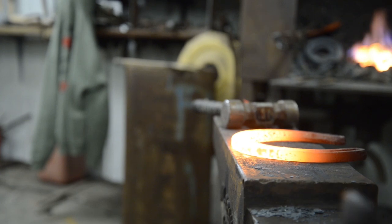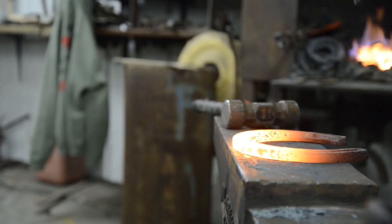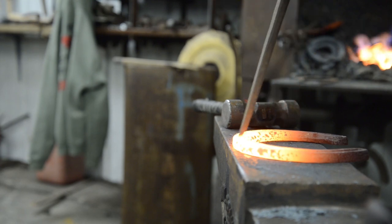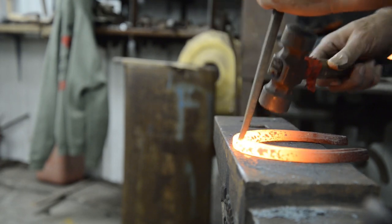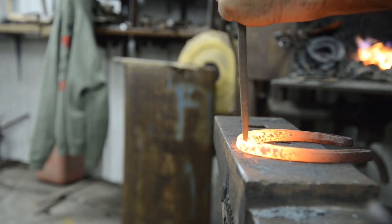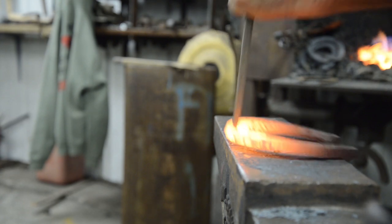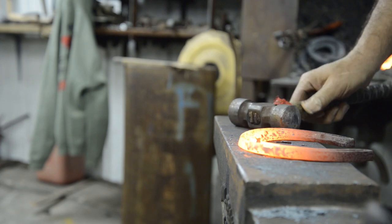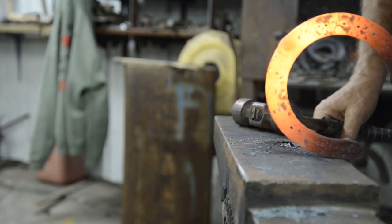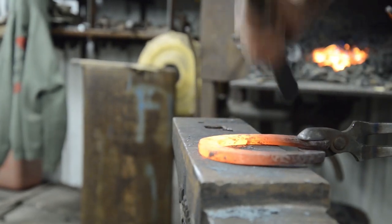If you pull a clip with a bob punch, you can see my bob punch for concave has a little kick in it. And so I'll put it in the toe of the shoe, and I will just hit straight down. More or less bottom it out. I don't want to cut through, obviously, but it'll bottom out. You can see that area right there. So I'll just forge inside of that slightly.